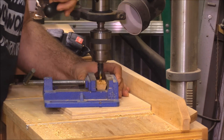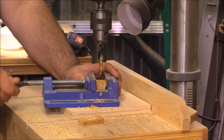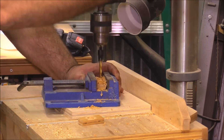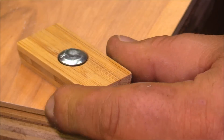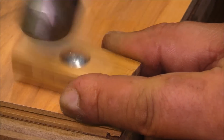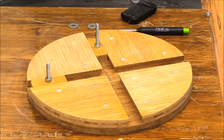I want to add some bolts to these slides, so I'm using the quarter-inch counter bore from my Izzy kit. This fits perfectly for quarter-inch carriage bolts so the head of the carriage bolt will sit below the surface of the material. With those installed I tighten the nuts down to keep everything secure in the slides, then double-check that everything is sliding like it's supposed to.